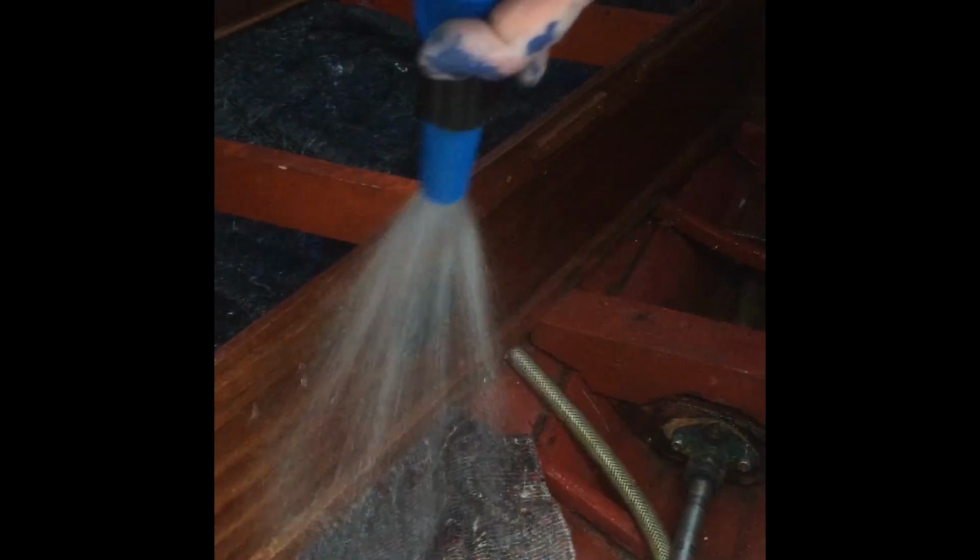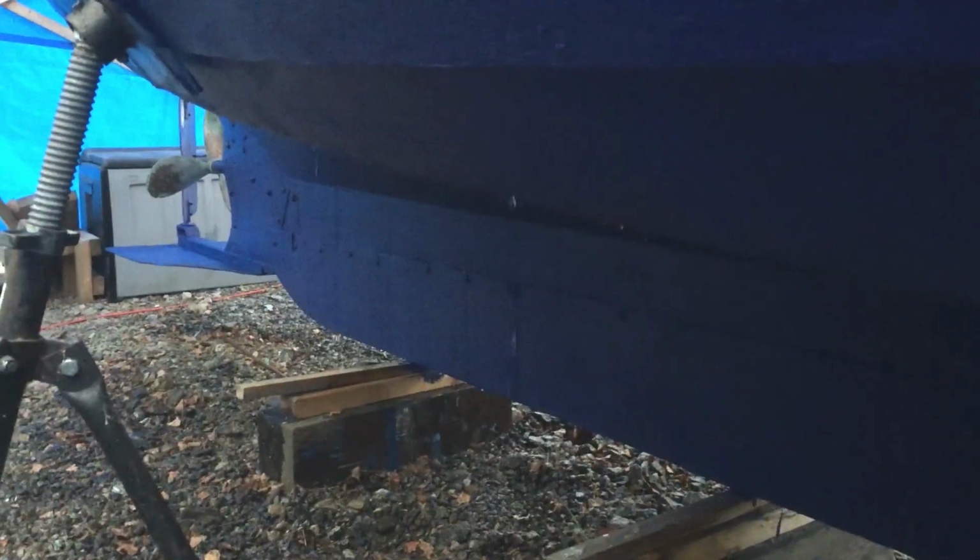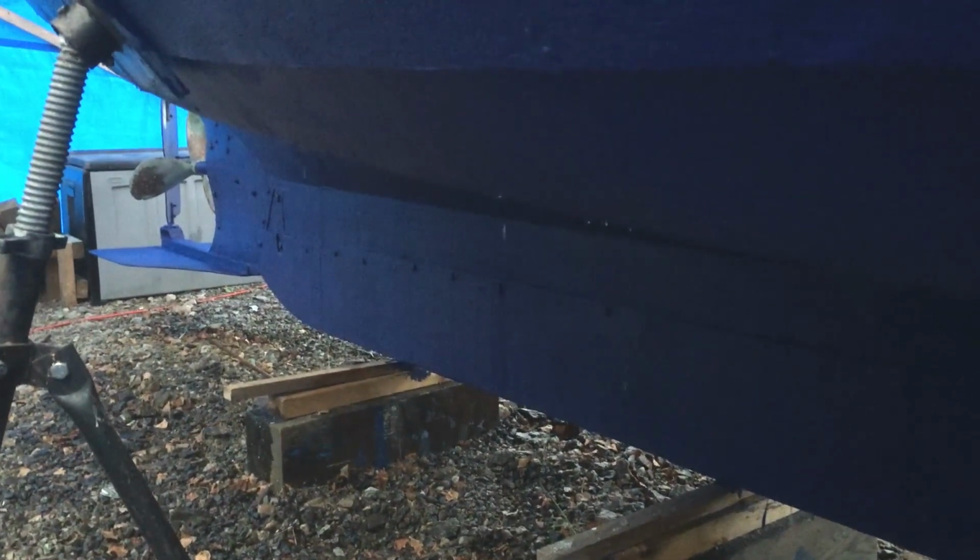When a wood boat is on land, the wood dries out and shrinks a little. So in between the timber, small gaps are visible. And she will take in water if put into the sea directly after winter storage. Therefore, wood boats need to be pre-soaked in water a couple of weeks before she goes into the sea, making the wood swell and close the gaps.